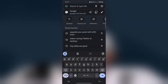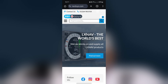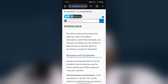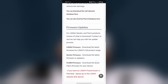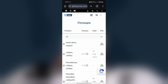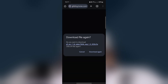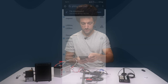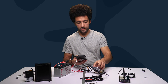Go to Navboys and then Downloads, scroll to Firmware Updates. For an LXNav PowerMouse, select the LXNav firmware and download the PowerMouse file. That will download the firmware file onto your mobile device.